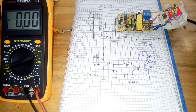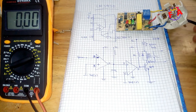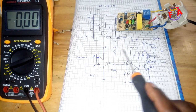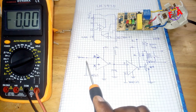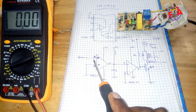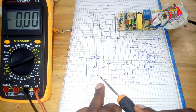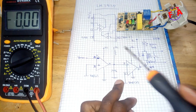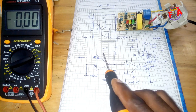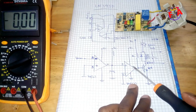So here you can see a simplified schematic of this protector. This is a comparator — normally inside it has two comparators. Pin number two is voltage sense. As long as the voltage on pin two is lower than V reference 1, this capacitor will start charging through this resistor. This is the time delay circuit and this is the voltage sense circuit — first comparator. The second comparator is the time delay power switch.